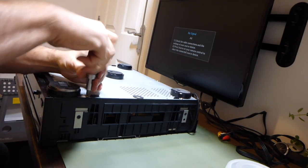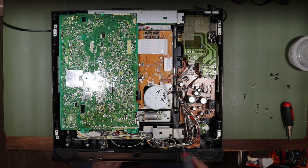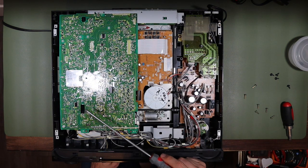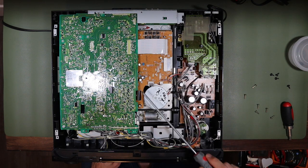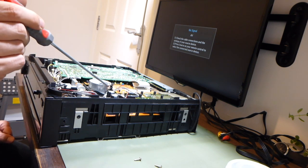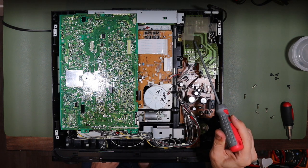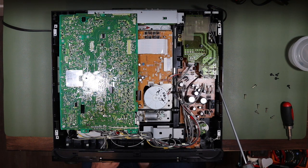There's quite a lot going on underneath. We have a main board — MP701 — and a second board which is probably a motor drive or laser drive board, since the motor connects directly to it. This board has a number of electrolytic capacitors but they all look fine. It looks like a voltage regulator or conversion board. Then we have a mains AC transformer with another smaller transformer on it. A couple of fuses on the face — they look intact — so I'll take a quick look and start making some voltage measurements.